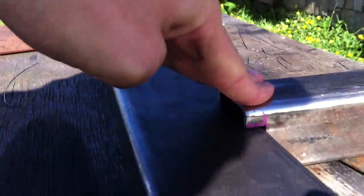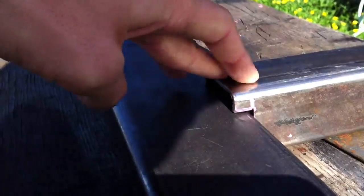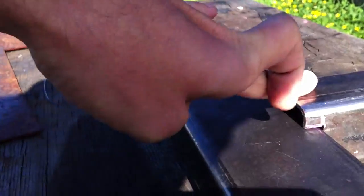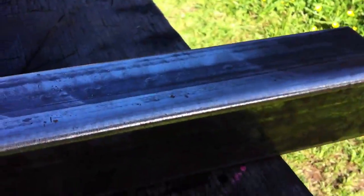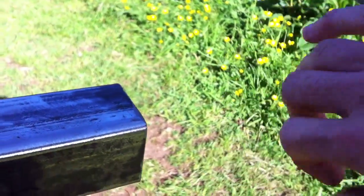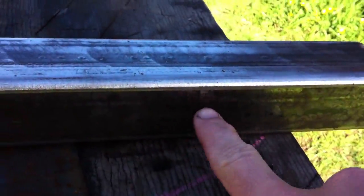These arms here will meet just like that. So it will be that they have that little notch. They'll be welded on top and on the bottom. This will be closed off right there. That gap will be closed off. And then, on the chassis side, there will be a plate mounted here on the chassis, welded with a plug that inserts into here. And then there will be bolts, probably 2 or 3 grade 8s that go through there and hold it on.